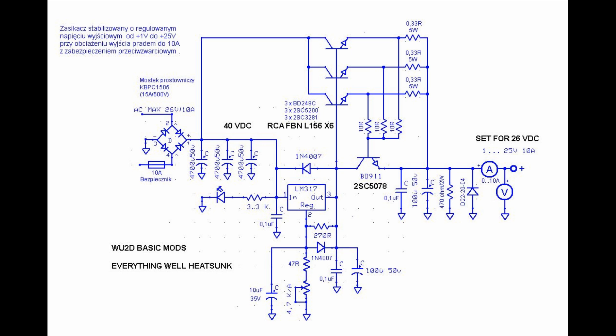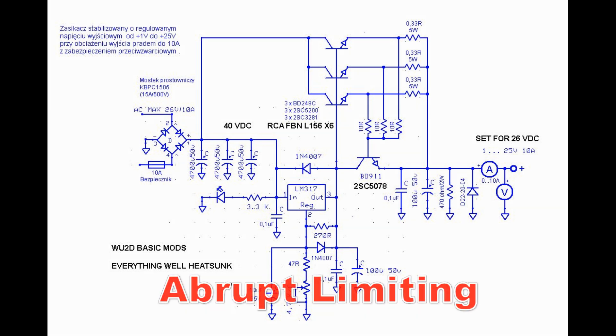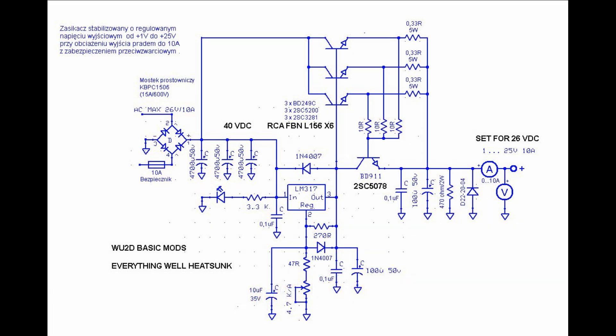This increases the power dissipation within those pass transistors. This is not ideal because the electronic circuit design stage allowance needs to be made for this high voltage condition. That might require a larger series pass transistor, as well as additional heat sink capability and higher voltage devices. Hence, I'm over-killing it because these transistors happen to be on this supply - it's using six basically 7-amp pass devices to share a load that might be only 10 amps.